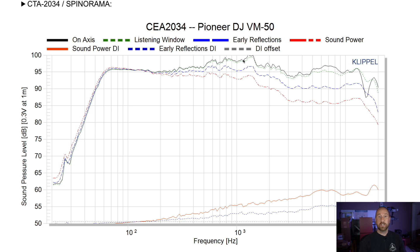I believe those are all due to standing waves from the internal enclosure itself, because if you do the math of the distance from wall to wall — height, width, depth — you get a frequency that corresponds with these three almost exactly. Then going a little bit further in frequency, we can see there's a dip on-axis around 3 to 4 kHz, which I believe is the crossover region. The manufacturer actually states to put ear level vertically between the waveguide and the midwoofer, but I tested that following their recommendation and it turns out they were wrong — you wind up with even more of a dip.